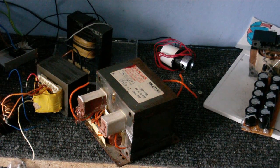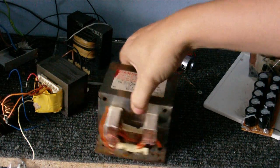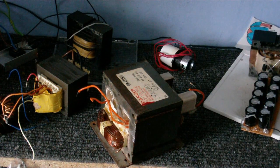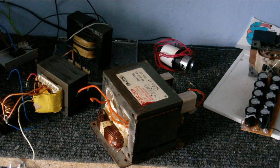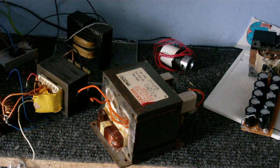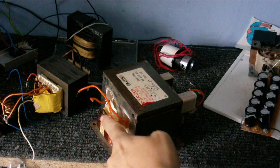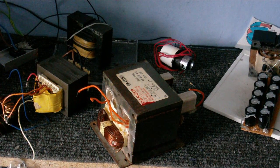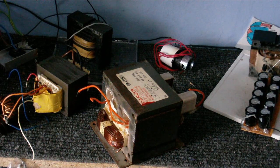I found out that if I cut the secondary at both ends it's much easier to hammer it out. The only trouble is the primary on this transformer is damaged. There's a big gouge here and it's completely open. I don't know how this happened, but I do know that not only am I going to have to wind a new secondary for this transformer, I'm also going to have to wind a new primary too. If I can wind at least three ohms onto there, that should be enough. So let's get out into the shed and finish this thing off.